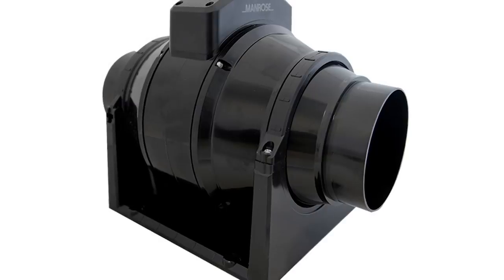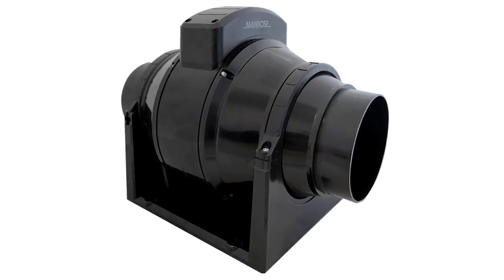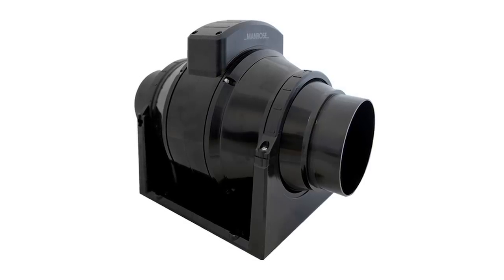If you've just had a ten-minute shower, it's going to take an hour before it clears all the steam — that steam is going to condense somewhere before it gets extracted. What you need is four or five air changes an hour. Six changes an hour if you're trying to clear steam while showering. So we looked at inline fans available from places like Tool Station and Screwfix — they're bigger, more powerful units with a duct on both ends that increase extraction rate enormously.